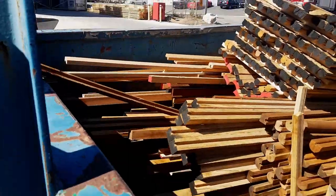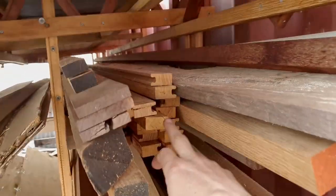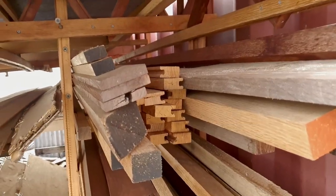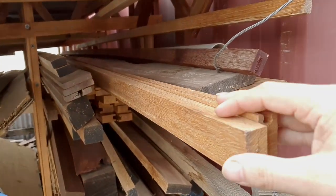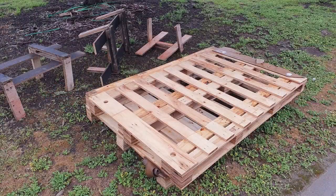A lot of it is really good wood — most of that's actually oak. And these are all rejects, and it comes in all sorts of different shapes and sizes. But what I think I'm going to use today for the composite beam as the main bit is these pieces. The main thing I'm trying to get across with this video is that you can make up some really strong beams with materials that you wouldn't think would be strong enough to be structural. You can use timber, ply, pallet timber, or whatever you can find. If you understand how these composite beams are put together, you can pretty much use whatever you can get hold of.